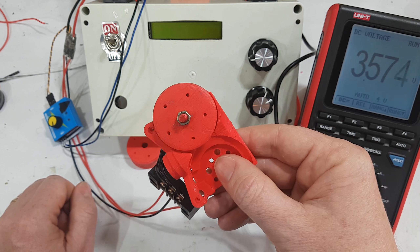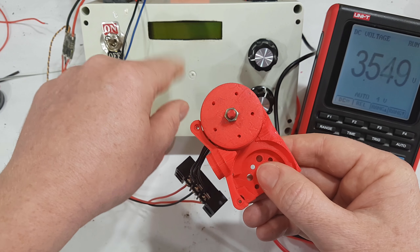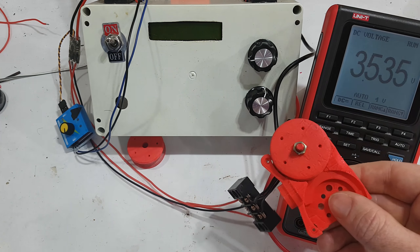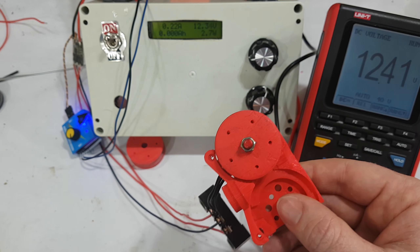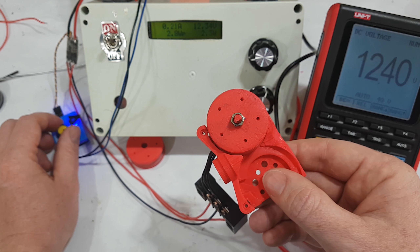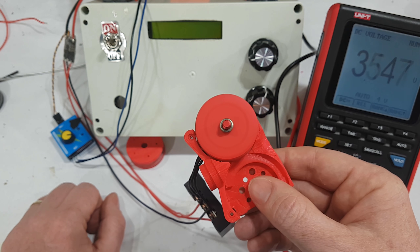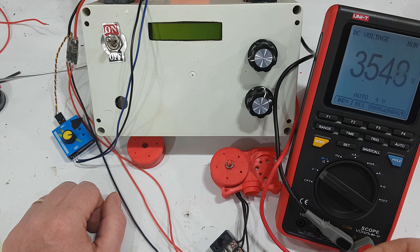Sometimes that voltage gets too high and it feeds back through my electronics — through my wattmeter, through my buck converter — and it actually blows the power supply. The implication is that you're also powering the Arduino, and the Arduino can only take about 20 volts, but we are going to be applying way more than that in a burst. Also, I've only got one motor here and we could have two. How we can deal with that is to add a battery, which is what you'd normally be doing.